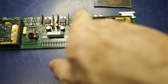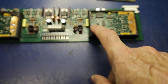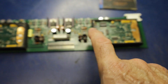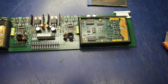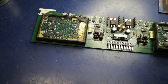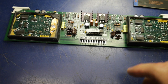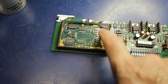On these two modules, the only thing I could find shorted that I could access was the op-amps on both of them. I pulled the op-amps out of the circuit and still had a short, so I knew it wasn't the op-amps and put them back. I then knew I was going to have to remove the whole module. I removed both modules one at a time, and the short ended up going away when I removed this one right here.